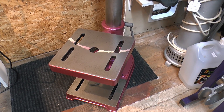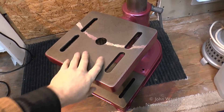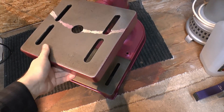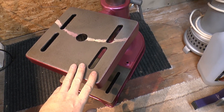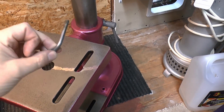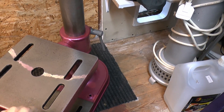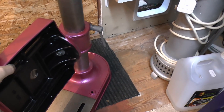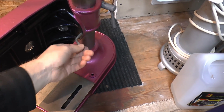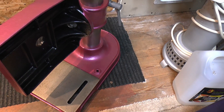Here on the floor we've got the base plate, the column, and also the table, and I've basically put these back together already, painted in the same pink. The table now does tilt and rotate properly — the mechanism at the back was all seized up and completely corroded, so I've cleaned all that off. There is a locking pin here which basically goes in to secure the table in one of three positions, though only one is actually much good — basically horizontal. The others are vertical and vertical in the other direction, and there's a pin for each.